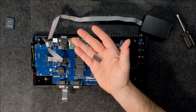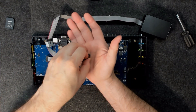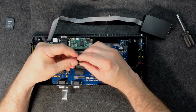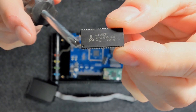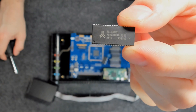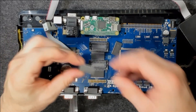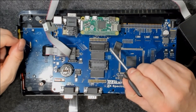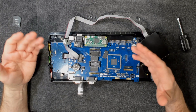Well, there's one of them — where did the other one go? Okay, I've lost my second memory chip. All right, it's over here. So there we go, two memory chips. To install them, let's see if there's a notch — there is. There's a little dimple in the lower left corner right here, and that needs to line up with the cut-off corner of the socket. Now I'll put the first chip in this socket — oh, I see the chip doesn't fit the socket. There are two pins free on the end.